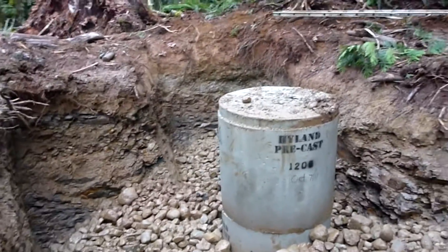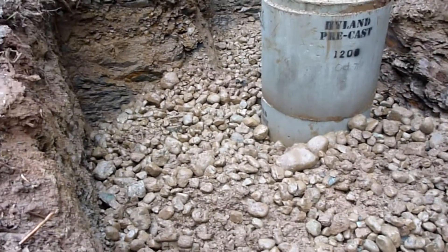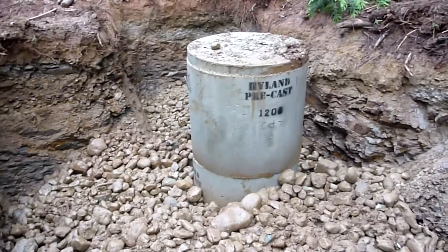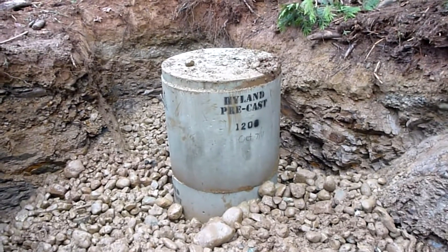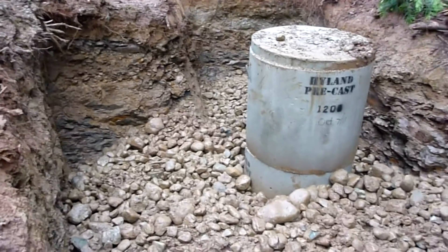After a full day's work, this is what we're left with. We've got one tower coming through to the surface; everything else is buried underneath a whole pile of rock. That rock we got was pretty dirty, plus trying to work in the mud — lots of mud — it got a little dirtier. Tomorrow we're going to attempt to wash some of that down: we'll recirculate the water, push it all down, end up with a pile of really grubby water in the well, which we'll then pump out. We'll probably have to pump it out a time or two as it fills up to get rid of all the fines and the nasty stuff.